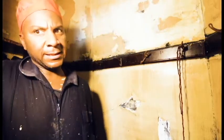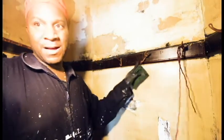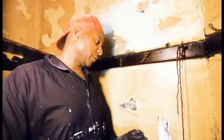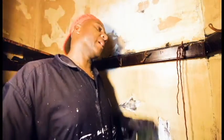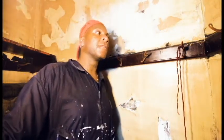As you can see, the wall is a lot cleaner than when you last saw it. This dark band here is some wood. I'll sand it down to make it as smooth as possible, fill in any imperfections with some plaster, sand that down, and then give the whole closet a coat of primer. In a couple of weeks we'll come back and take a look at what this room looks like.